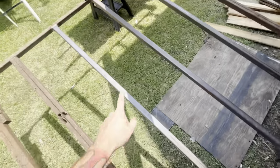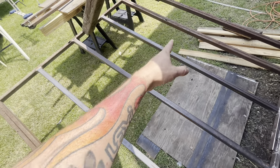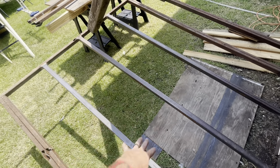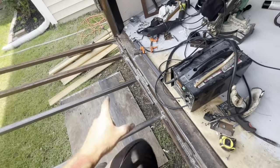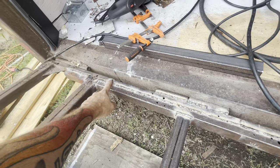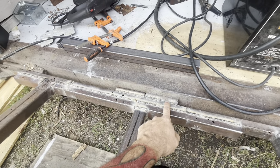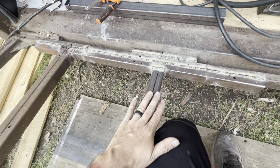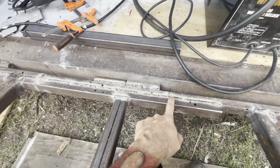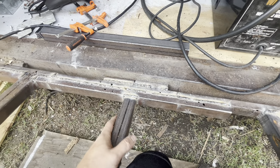We still have to buy metal and two sheets of three-quarter-inch plywood. On this, I've used up my three pieces here — remember the three pieces I bought from one stick. These were really bad, broke in half, and I went ahead and replaced them with solid pieces and figured I'd scab everything else. The section down here that was completely busted with the whole hinge — we actually cut it out right here and here. That was the busted piece the hinge was on. We replaced it with a solid tube we cut out of here, so we repurposed the good sections. We went from there to there, then scabbed over it all the way to here and did long welds on both sides to give it strength.